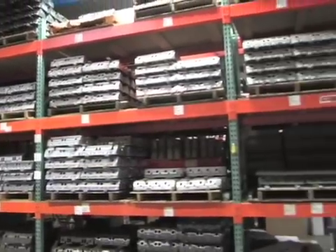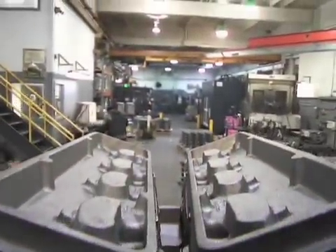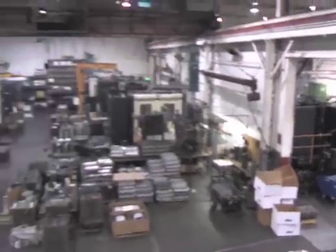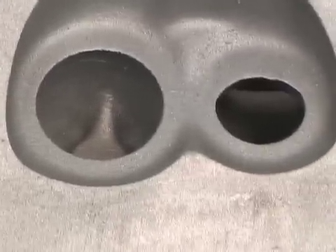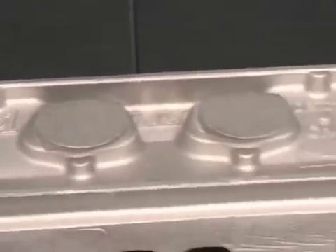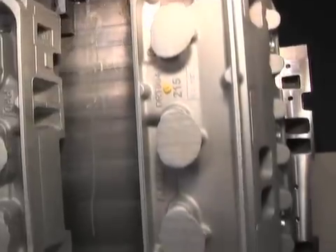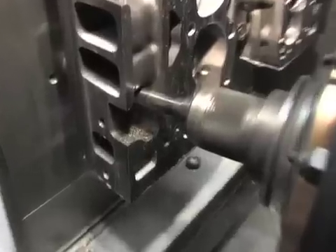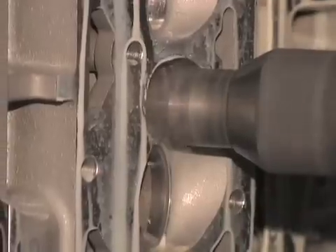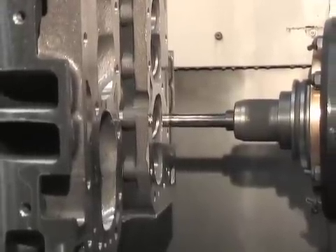Now that you have an understanding of the technology involved in developing Dart's heads, let's see how they are manufactured. Dart's machining center is where all raw iron and aluminum castings are received. All castings are designed with tensile strength in mind — the idea is to allow the heads to flex so they do not fracture, but in a way that allows them to return to their original shape after a heat cycle. All heads are machined on an eight-station cube fixture, which simplifies the process of turning heads from raw castings to finished products. Machining operations include clearance for push rods, initial valve job, valve spring seats, valve stem holes, and all mounting holes. Iron heads differ slightly by the cutters used and the machine time.